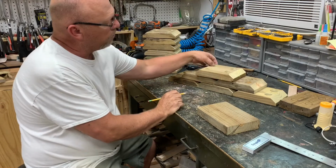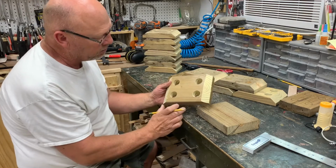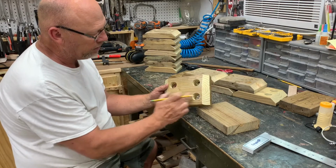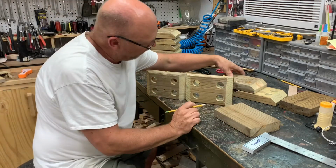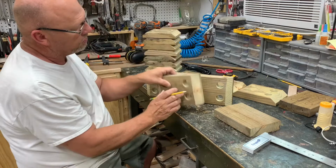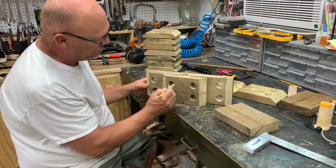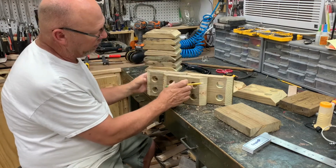And so what I've got is 4 holes drilled. These are 8-inch blocks, 4-inch centers. I think I went 1.5 inches on the inside here. That dimension didn't really matter, but the 4-inch center here did, because when you go to stack them, I'm gonna put some pins in here that'll stick up probably about 1/2 inch, and when you go to stack them, the 4-inch centers, and these being 2 inches in, that puts this here the same width, so that these will stack.